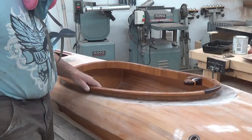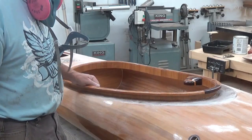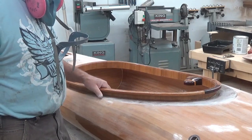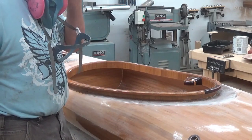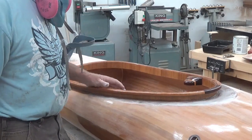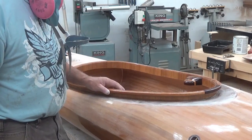I'm moving through the process of varnishing the final coats on the kayak. I used the Sea Gold, which was the no-sand water-based varnish. I ended up with four coats on the deck and the hull out of that one liter, and now I'm working through multiple coats of the high gloss.